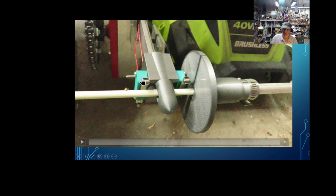One set of switches goes to the logic of the mower. So if that contact ever gets broken, well, it's just like releasing the handle, the mower blades stop. The other switch goes to the autopilot right now, the orange cube. It just tells it to stop the motors. I will be switching out, like I said, now this is not the best practice, but it's what I got right now, to solid state relay.